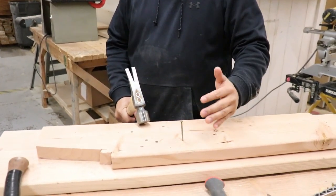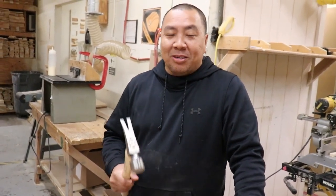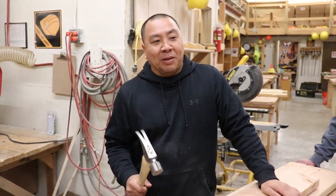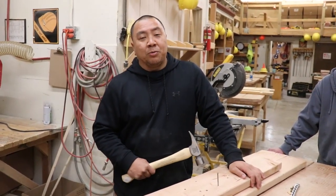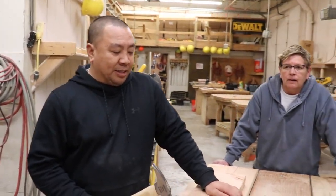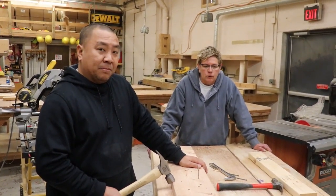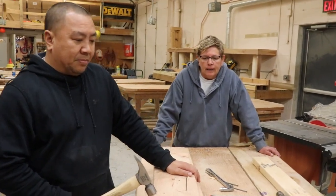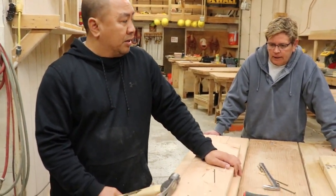You want to be able to nail, but in the real world you're not going to be using your hammer constantly. The hammer is there to nail or beat certain things, but mostly you'll be using a nail gun — which we'll get into later. There is one area where you will nail a lot, and that's in concrete forming. You'll use your hammer a lot there because we use duplex nails to create those forms. But otherwise, you won't see a lot of hand nailing in framing.